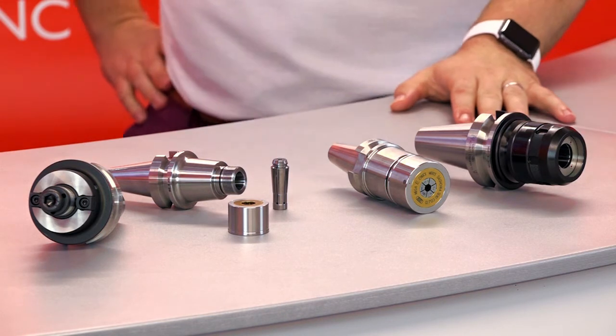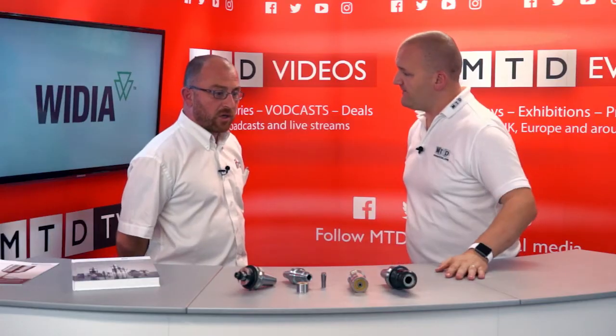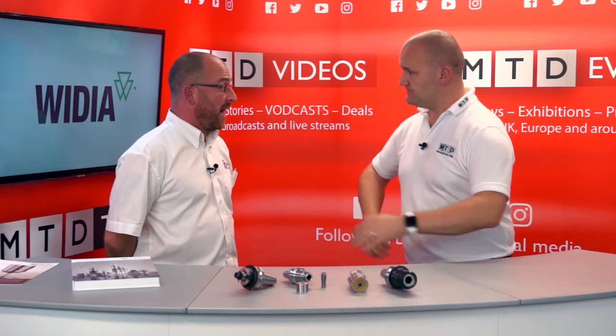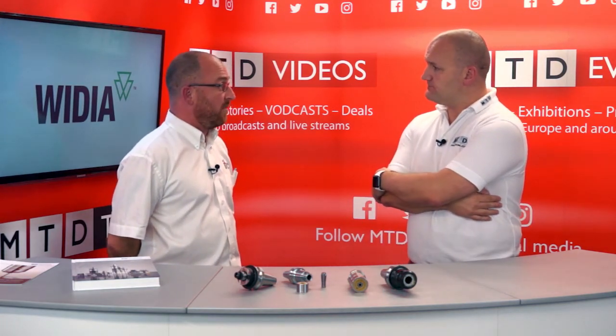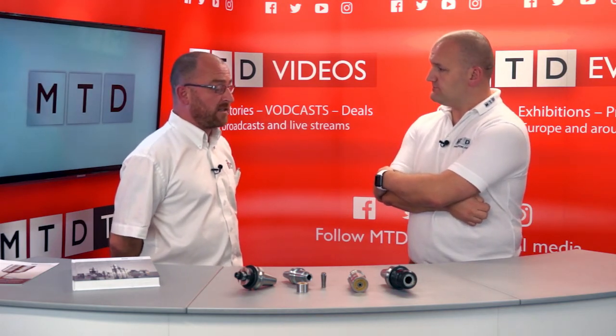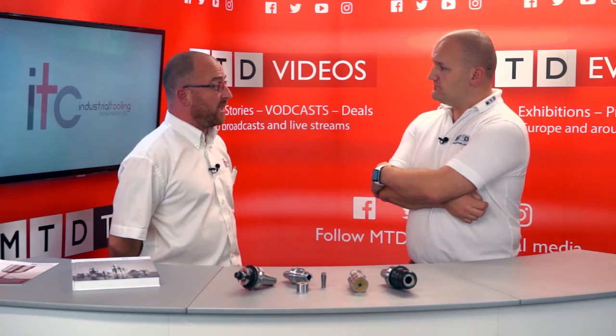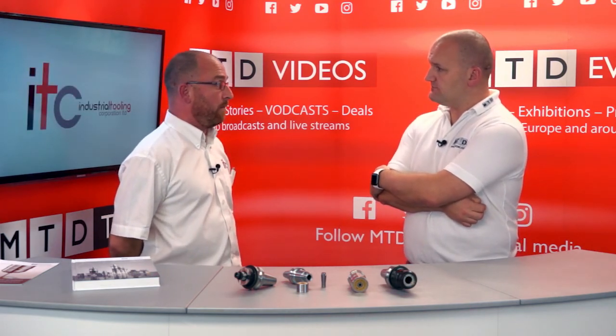So we've talked a lot about run out. Yep. But how balanced are these tools? Okay, as a company, Big Daishowa don't actually print a balance G measurement. They don't believe in it as a practice. They think there's too many variables in the way that it's measured. What they do is they guarantee a run out to a maximum RPM.